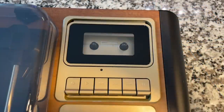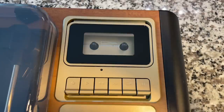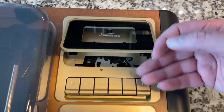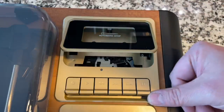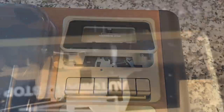Now let's look at the tape player. The way they've incorporated the cassette player in here is really, really cool. It's got auto stop and basic transport controls. It does record — I know you can record from the radio to tape. Let's eject here. That's interesting — the mechanism there looks like it might be metal. What really matters is the head mechanism. And what to my wondering eyes do appear — that is a stereo head! That is super rare these days, so that is really great. Hats off to Jensen just for that alone. You can see the blue erase head there. Excellent.